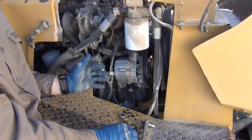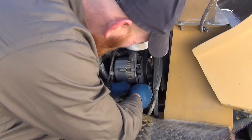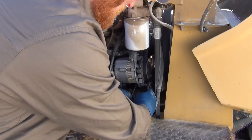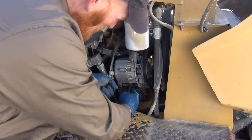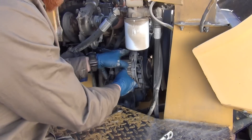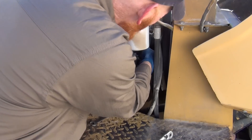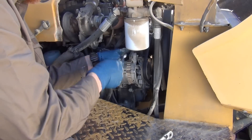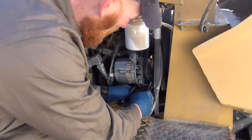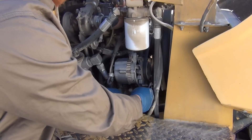The first thing we do is identify the bolts to loosen — there's these down here and this one up here. Just get a half-inch wrench. These are through bolts, so you've got to hold one side. Once it's loose, you just pull back on it — pull out all the slack. You want about a half inch of deflection or movement on the belt. Then tighten the tension bolt down first; that'll hold it like a bookmark. Then go back through and tighten the other bolts down, and repeat.